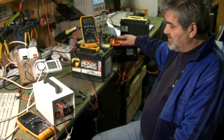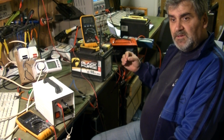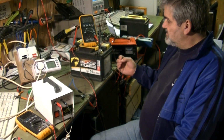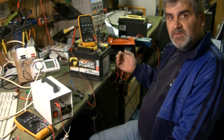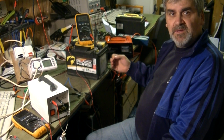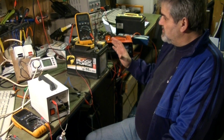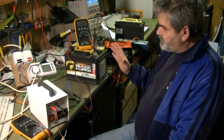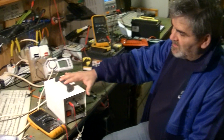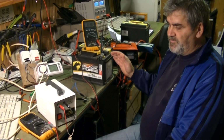From electrochemistry we also know that efficiency increases by decreasing the current, which means less current to the battery or to the electrolyzer, and the efficiency will be better and better. That's why I try a new approach to charge the battery and to drive an electrolyzer by reactive power.